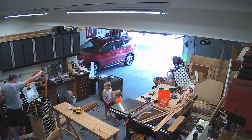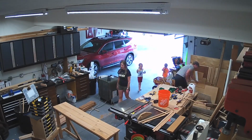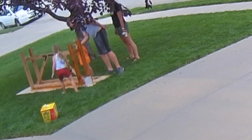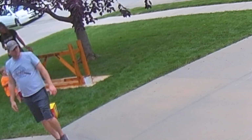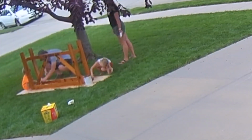The next morning I had some helpers that were pretty eager to help me stain this thing. I gave the top a quick pass with the sander and let them get to work. I used some ready sealed deck stain I had left over. They market this stuff as goof proof, and if these two couldn't mess it up, then I think they're right. It's an oil that soaks in instead of sits on top, so there's no brush marks or anything like that. You just spread it out and wipe up any that stays pooled.